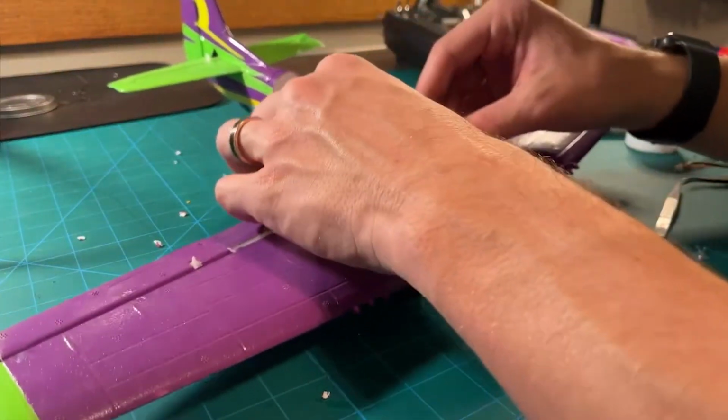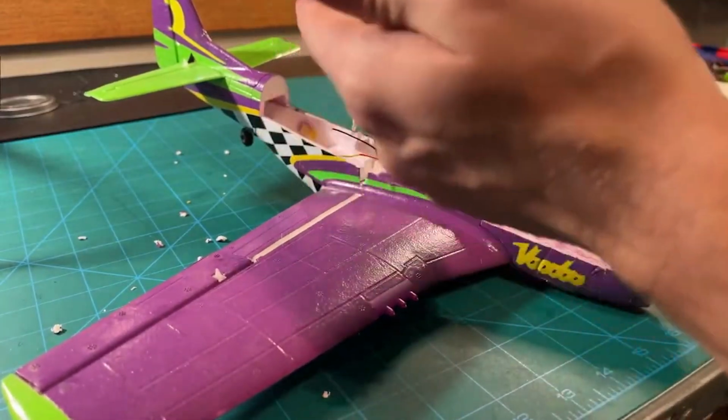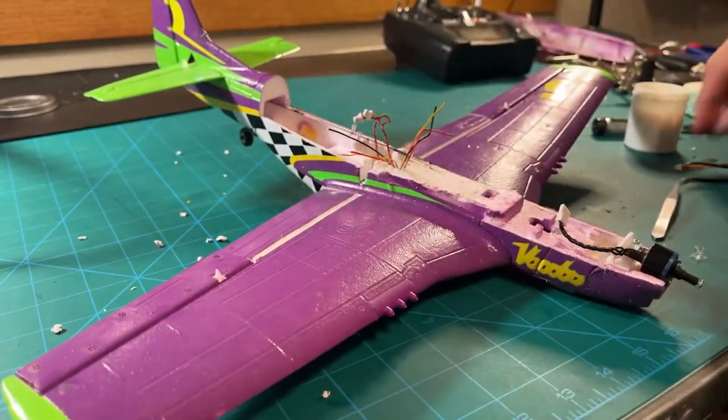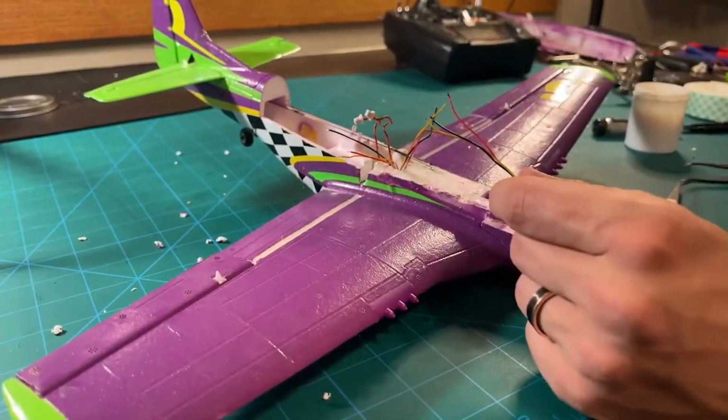And if I flip this over, we can see we've now got some nice wires poking through. We can just solder black to black, red to red, yellow to yellow, and then from there we can solder onto this adapter in the correct format.